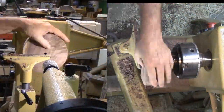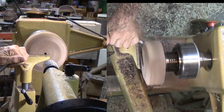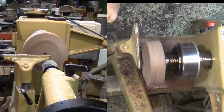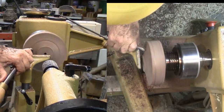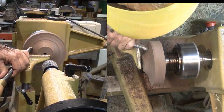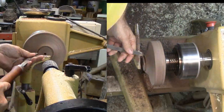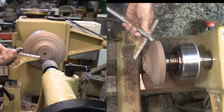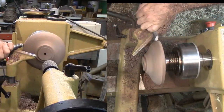That's time to flip it around. I'm taking it off the screw chuck and remounting it to a four-jaw chuck. I'll mark a mounting tenon on this side also. I'm stopping for a bit to mark lines for an OG curve — two lines on each of the top and the side: one for the extent, one to divide it in half. It's unfortunate that I tried to true up the tenon with my parting tool. I overshot my mark, and my tenon wound up just a trifle small. I'll have to deal with that later.